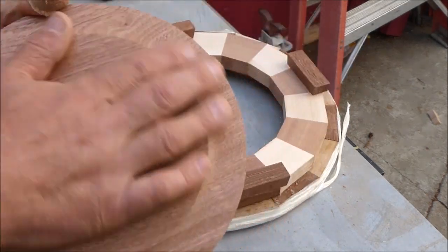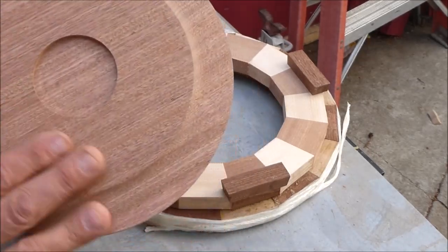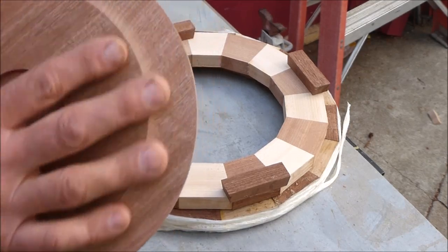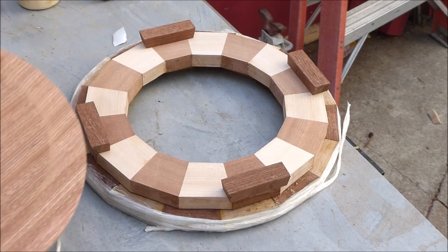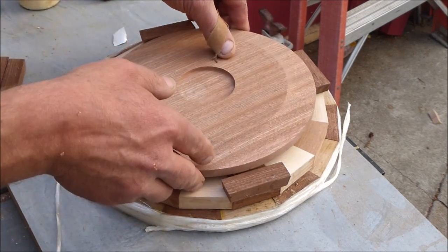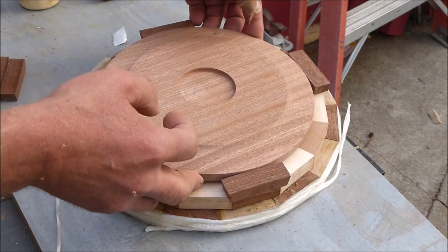you just saw me shape this with the tenon or the mortise on it, and I'm leaving my faceplate attached here so that I could still do some turning on the bottom of this if I need to, which I will. But at this point I'm going to be gluing this up, so I wanted to show you I use these 4 glue blocks to position it appropriately.